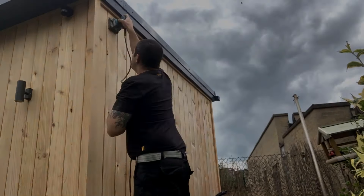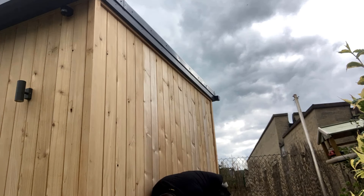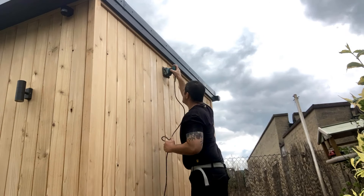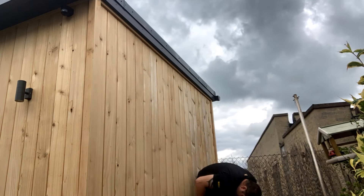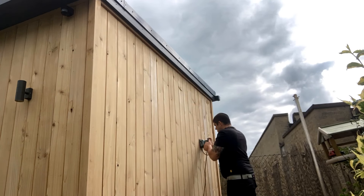This is something the manufacturer of the oil recommends — just leaving the cladding installed for a few weeks before you actually start applying the finish. What I'm doing now is taking the top surface off with the sander, because it has started to weather a little bit and the colour has kind of dropped out of it, so sanding it gives it a fresher look.